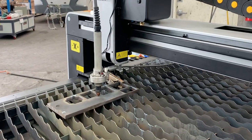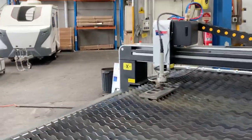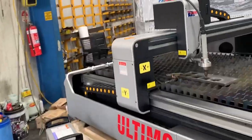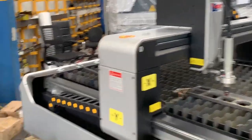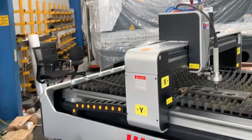We've got this one wired up with a Hypertherm PMX 125, which has become one of our most popular power sources being sold amongst fabricators. It'll blind pierce and cut 26mm, but we can marry this machine up with whatever power source requirement you need.